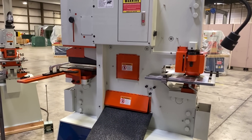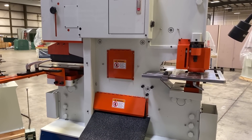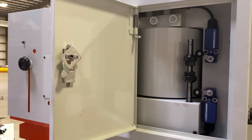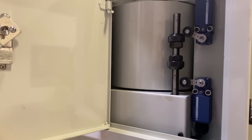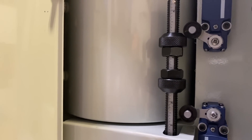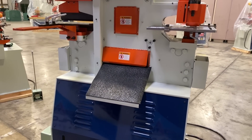The rear of the 66KB and all K-series machines features through-bolted construction into both sides of the frame, and the internal slide moves up and down using bronze guides. The limit switch and stroke controls are located in the cabinet, as well as the integrated hydraulic cylinder which is the only cylinder that moves the internal slide. The stroke control features knurled adjustment for fine-tuning the stroke. The machine also includes a standard 40-inch electric back gauge.